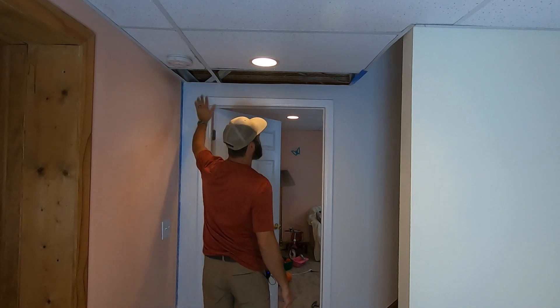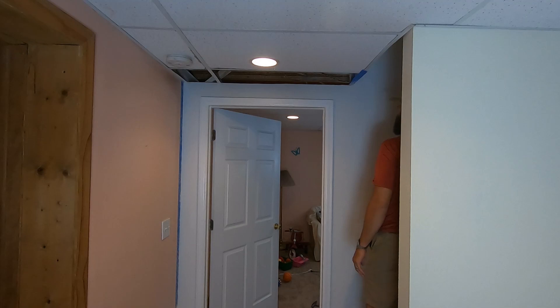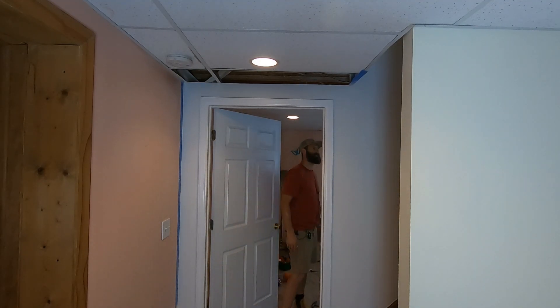This is some perfect texture — they already can't believe it, and it's still not even painted one color yet. They just can't believe it. You call the professionals and you get professional results. Here's a close-up — keep in mind this has one coat of primer on it. You really can't tell anything. This is the existing wall. Another thing I suggest when you're trying to match texture is use a heavy nap roller — like a three-quarter inch nap roller — and it puts a little even stipple on everything. It does a little bit more blending.